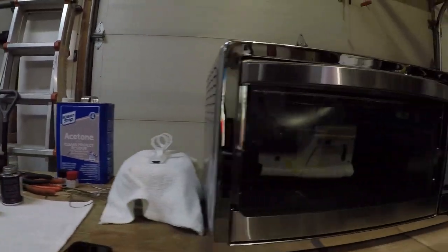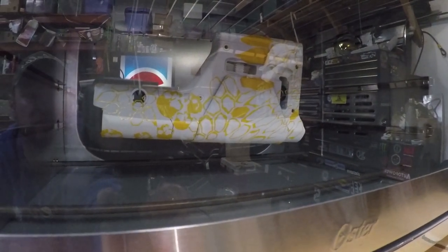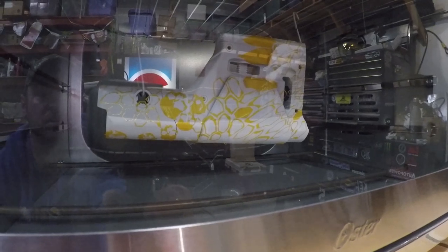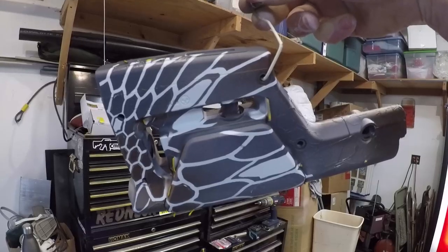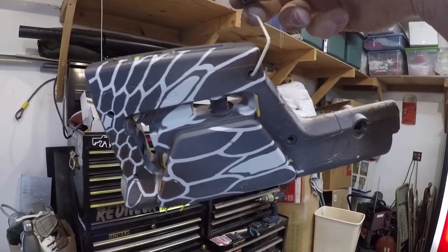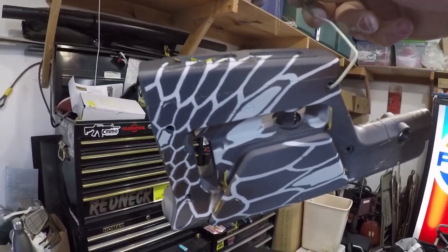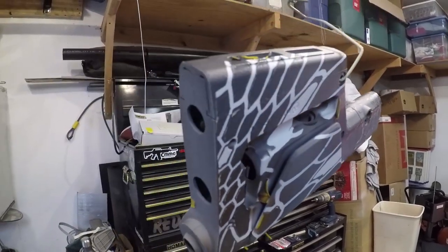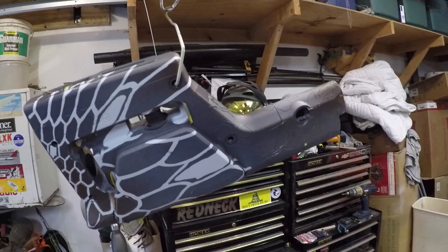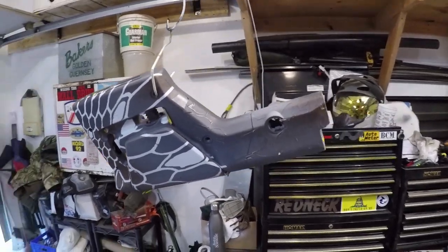We do have the buttstock in the oven. It is heating up nicely at 200 degrees and it's been in there for about seven minutes now. You can already start to see those decals are shrinking down. So let's take it out and make sure they're all sticking the way they should. I got a little impatient and started pulling some stencils off to see how it turned out. There are still a lot of stencil pieces that need to come off, but we can let it cure up a little bit more and let that plastic really get hard.